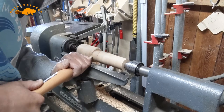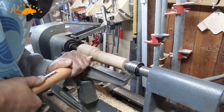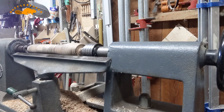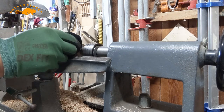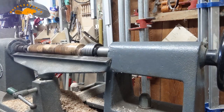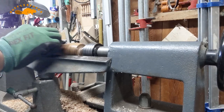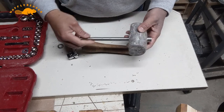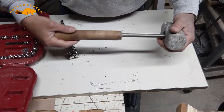I'm not following any plan for how I shape the handle, so each mallet handle will be unique — I think I like it like that. The best thing about having a lathe is being able to sand and finish a piece on the fly. Running the lathe in reverse and adding coats of polyurethane and wax gives this handle a soft and smooth feel.